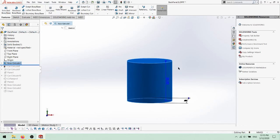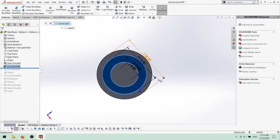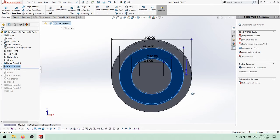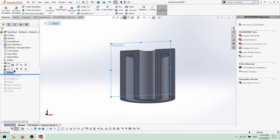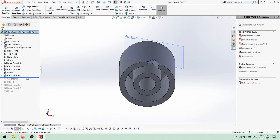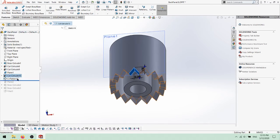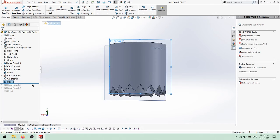As in the other parts, this one was started with a 20mm wide cylinder extruded 20mm tall. As in the head joint part, a section was cut between 10 and 16mm diameters, offset 2mm from the opposing surface. The hole for the bolt was cut out through the part as well. A reference plane was created, this time in the parallel configuration. Teeth of the same size as before, 4mm wide and 3mm deep, were cut and patterned into the part up to the inner surface. Another plane was created opposite to the first to start the back panel connector.